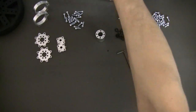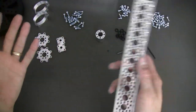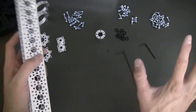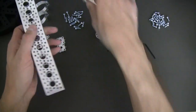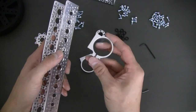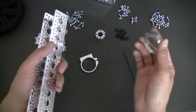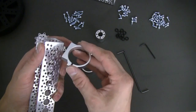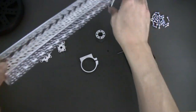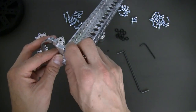We're now going to start the assembly of the three-wheel robot kit. The kit comes with two pieces of channel. The neat thing about the Actobotics line is that you can modify and change this kit with additional parts you can purchase online — we wanted to build the most simple kit to get you up and running. We're going to go ahead and put our motor mounts on. This kit comes with our 37-millimeter across motor mounts. You can swap those out with different motor mounts depending on what motors you choose — these work well with our 3 to 12 volt gear motors as well as our 12 volt precision gear motors. We're going to mount these on the end of the channel.